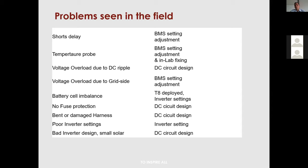The important implication: as installers, you simply cannot short circuit your system. Do not put any positive line onto the big lugs of your BMS, otherwise you will short circuit and blow up your system.